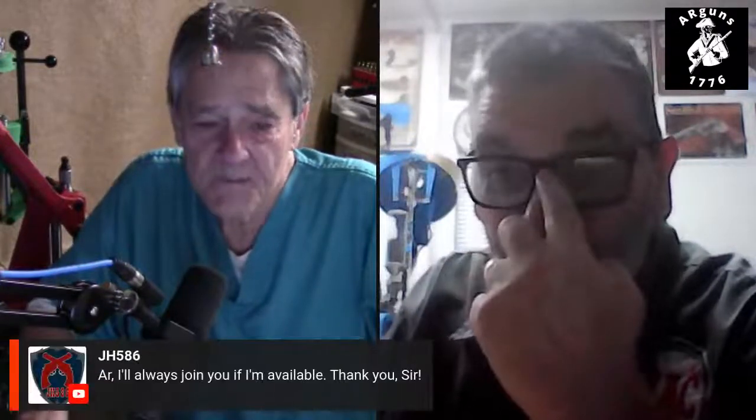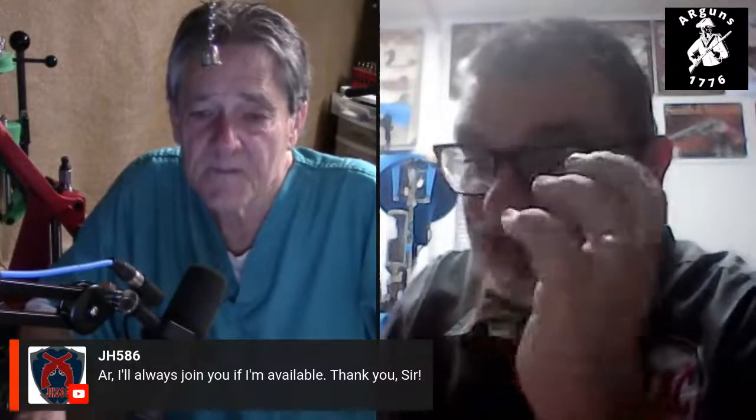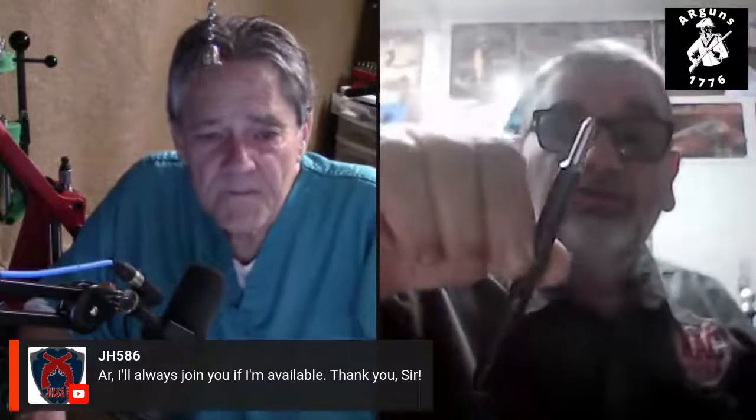Definitely. You swage on the 1050? Yeah, it's got a swaging thing on it. Does it work well, you think? It's okay. Because the way the Dillons do it, they push that swaging rod into the primer pocket, and it's moving brass, isn't it? I much prefer the RCBS, where I cut the brass away. But if I'm just processing a load of 223 or 556, I'll just throw it in there and let it do it. I have upgraded the swage pin on the 1050. That's your swaging pin. So I have upgraded this to, I think it's Family and Friends or Friends and Family, who make a few reloading parts. I don't know if you've ever seen them.